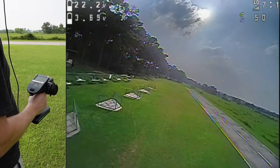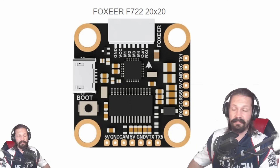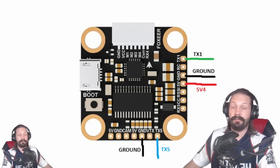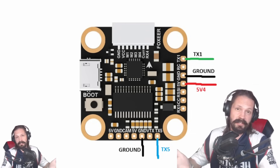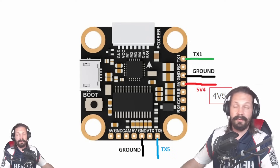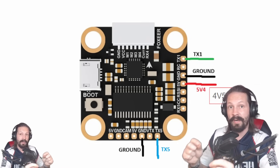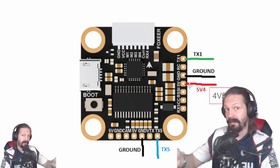Launching is a little hard because your hands are kind of moving around - you just need to watch for that, but it's just so natural to fly it in FPV. You need a Betaflight flight controller. I'm using Foxeer F722 20x20 - that was just laying on my table. By the way, you're doing everything here at your own risk. We will need to solder five wires total, and ideally find two separate UARTs, two separate grounds, and this 5V pin - which is actually 4.5V. You can find it by plugging USB into the flight controller and checking with a multimeter which 5V pad is powered from USB.